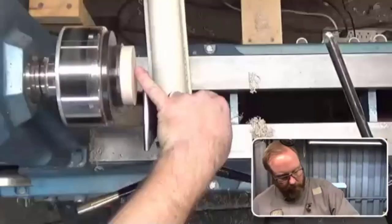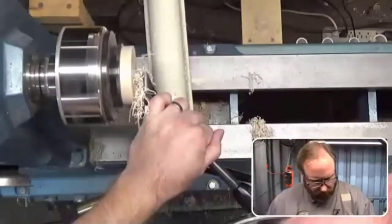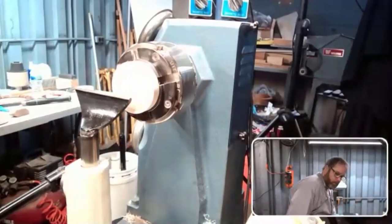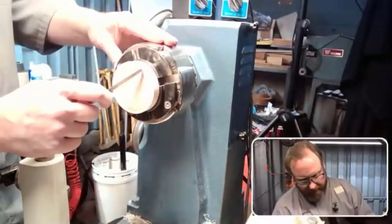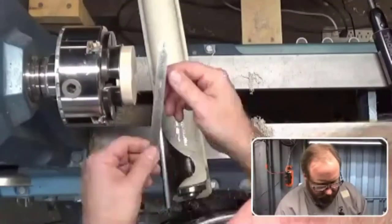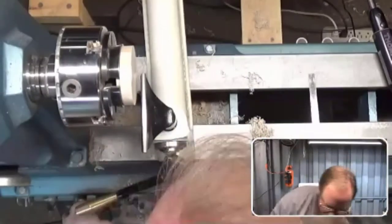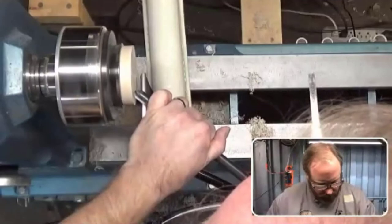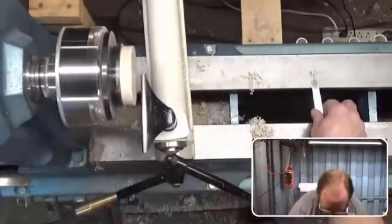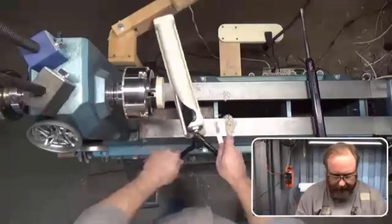So what I'm going to do is undercut just this middle part to get that wood out of the way, just slightly. Okay. And again, I'm doing this because all I really need flat is just the area that I'm gluing to the next segment. Okay, and I can see this is my high spot right here, not quite close enough that I could just sand it out. So I'm going to go ahead and do a little fine tuning, and back and forth to the straight edge. Okay, so now we're close enough that I can sand that into place.